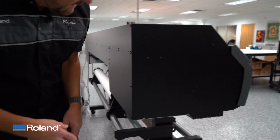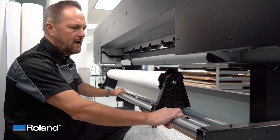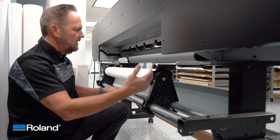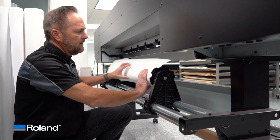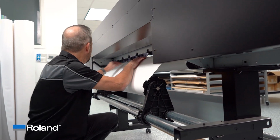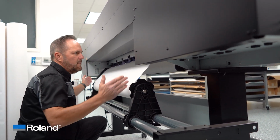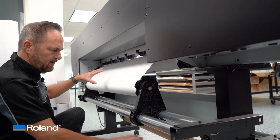And then we're going to go around the back and cover one more area, and that is right down here, these flanges and these rails here. So from the factory, as long as the machine was set up correctly, this will all have a very, very good alignment. That's really critical, because this is the first point where the material is going to be coming up into the machine. Make sure that they're in line and that there's nothing that it could intersect back here.